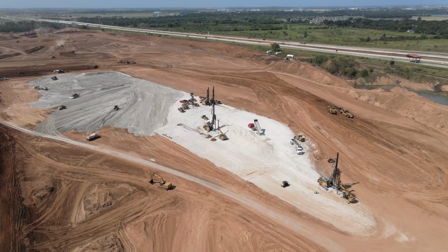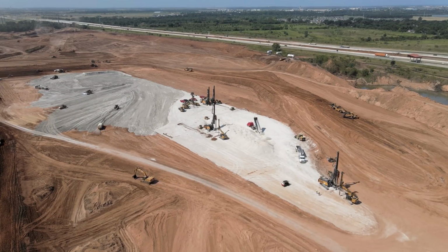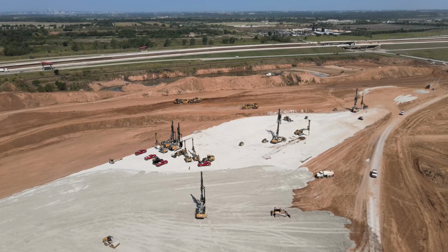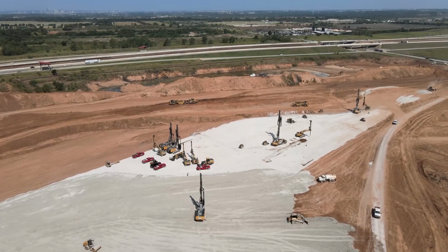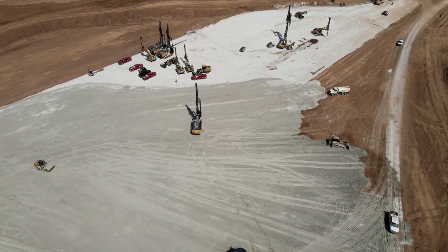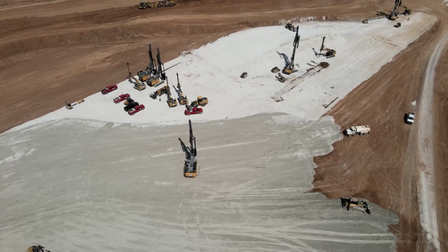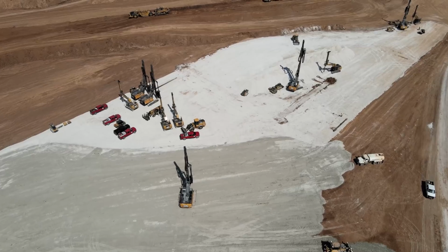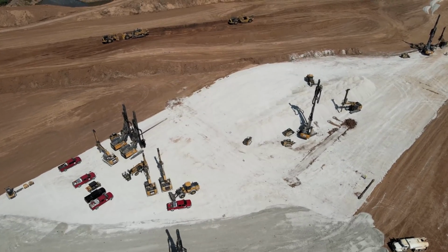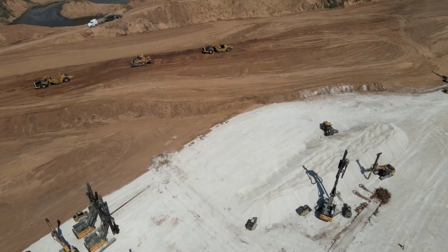Now that being said, I just want to kind of think out loud with you guys. In conventional construction, you shoot your rough grade, then you dig for your footers, then you form and pour your footers, then you backfill and build your building on top of that. In this case, where they're bringing in so much material and filling it, I kind of question if they are going to fill this whole thing to finished grade. I would suspect that they're going to handle it more like Giga Berlin, and the height we're seeing is going to be footer height. And then when they bring in more material, they'll use a new material to then bury the footers. And that'll save filling it, digging it back out, and filling it back in again. But like I said, that's just a wild guess, and we'll have to see how it works out.